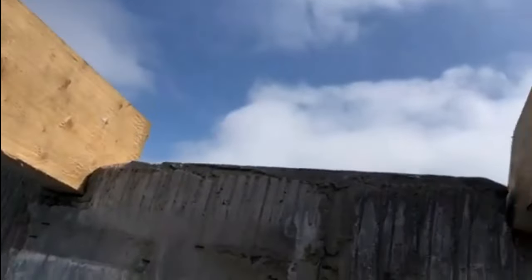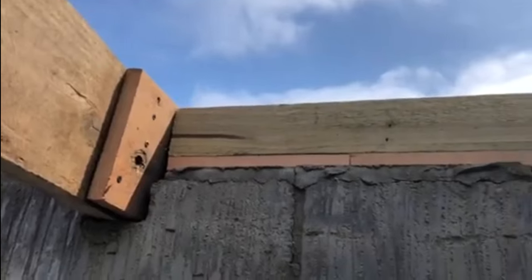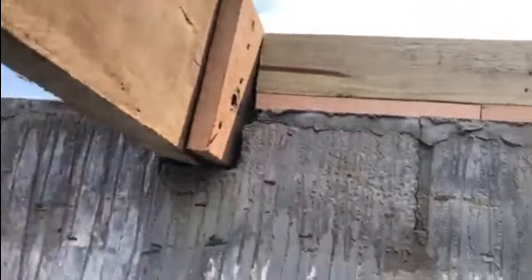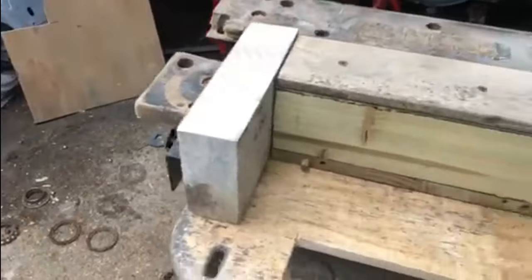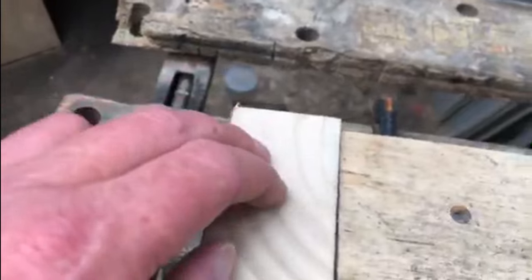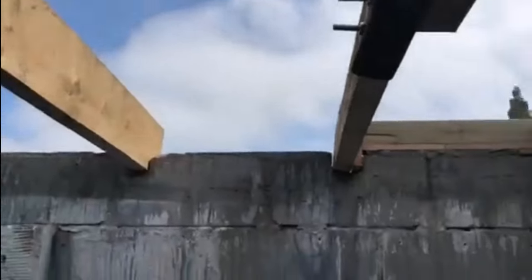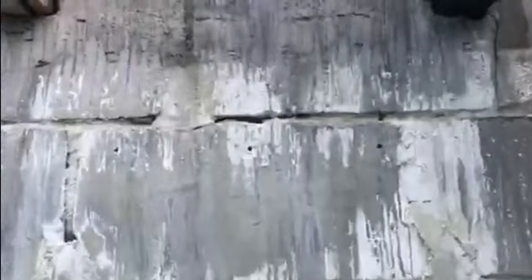Previously up there in these gaps between the joists that was all concrete, but it was all crumbly and rotten when the roof came down. I wanted to part the roof off so I've had to make that. The way I've made it - you might be able to see there's a few layers of wood to cover the holes and fill the gap so it's all nice and level. And here's what I'm in the middle of making now. I had to go and get a fence post, so this bit here is a three by three fence post. That bit there is a bit of that wood over there, and this bit on top is a bit of this that I've just cut off. These two blocks cut from a bit of scrap wood. The idea is I'll screw this bit into that bit, and obviously that bit into that bit, and then once this goes up there between the joists I can screw these two end pieces straight on the side of the joists up there, pretty much like I've done with this one. You can see the screws there going through into the joist, and in that one as well.